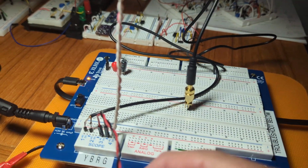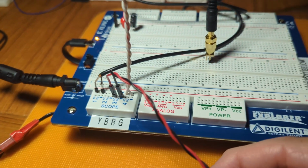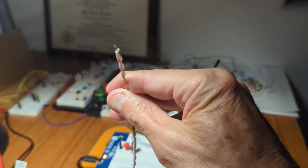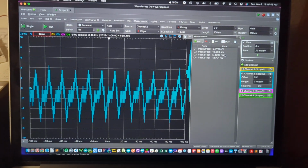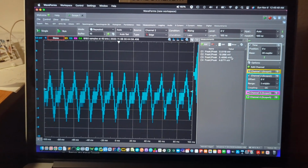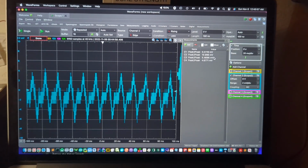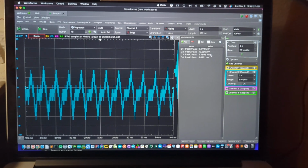And then I've got this just simple twisted pair shorted out there in channel 3 and channel 4. And this is a tightly twisted pair into channel 4, just a solid piece of wire there that's shorted at the top. Those all look the same as channel 1. I won't bore you by going through that. So if you've got any kind of a probe that's connected in there, you get about the same 5 millivolts peak to peak. If you leave the channel completely open, not shorted out, you get 11 or 12. Everything that's happening is at 60 hertz.